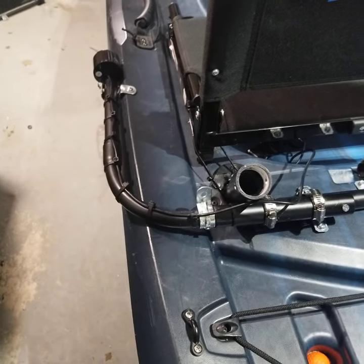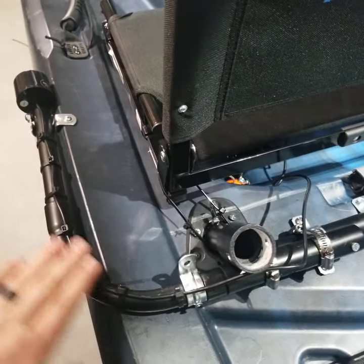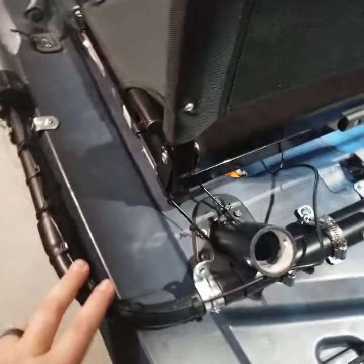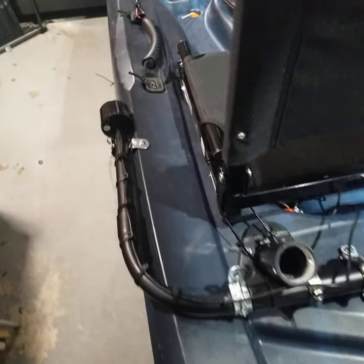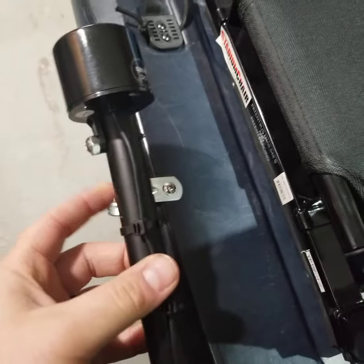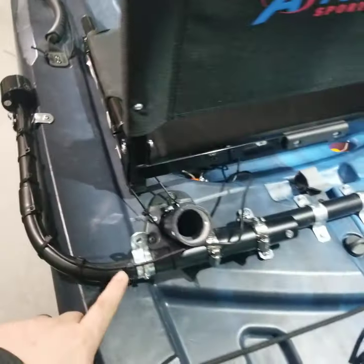Let me show you a little redneck ingenuity here. I got some half-inch electrical conduit and made this arm for the transducer. I use electrical conduit because it has really easy, gradual bends — not like PVC with only 90-degree angles — but it can still do 90 degrees. It's also stronger than PVC, like schedule 40 or something. I screwed the transducer to the end nice and tight, and there's a little clip it rests in that's used to mount the conduit and keep it against the hull.